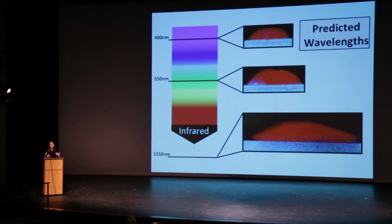The center of each island is 97% indium. So we did it. We created self-assembled nanoantennas. We're not done yet. The size of the antenna changes what wavelength it works with, so we can't settle for only large islands. We need to figure out why our smaller islands look so bad and how to fix them.